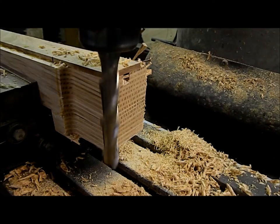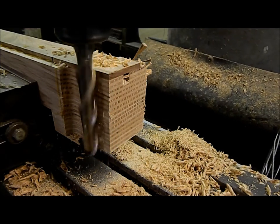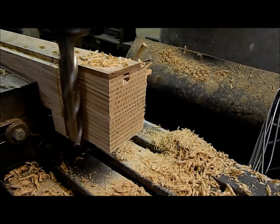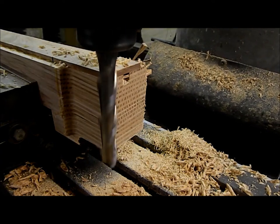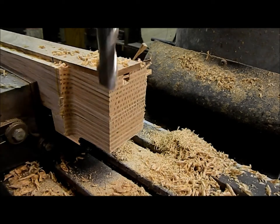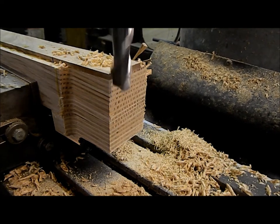I'm gonna take a hair for our finish pass. About 3 thou. Let's give that a nice graze. There she is. Square as can be. The back side we have to cut opposite of the way we just cut, because we have to climb mill this. Important. So that's what it is.